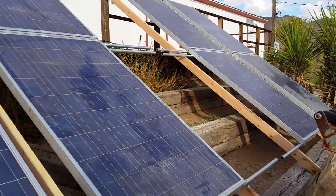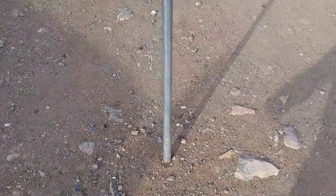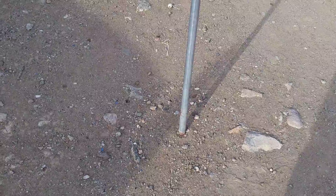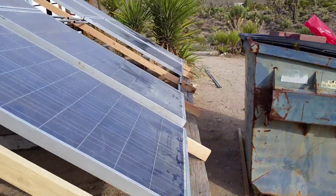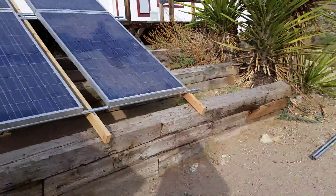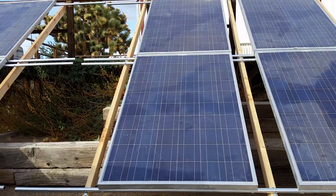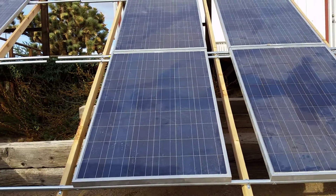When we had a lightning strike, each one of these poles had 24 inches of rebar sticking six inches out of the ground — leaving 18 inches in the ground — and you run the nut tight against the rebar so the pole is going nowhere. It's also grounded. I had 11 of these holding up 10 panels at Burning Man last year. We had an area-wide lightning strike all around our camp, and one of our campers had their solar hardware burn out — nothing happened to mine. It didn't even phase it.